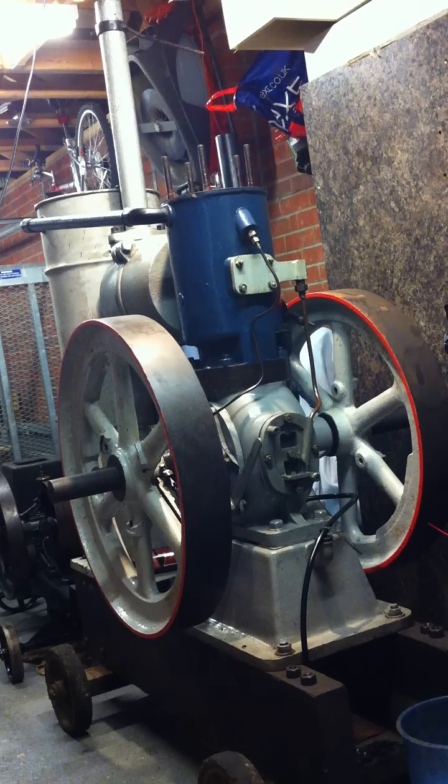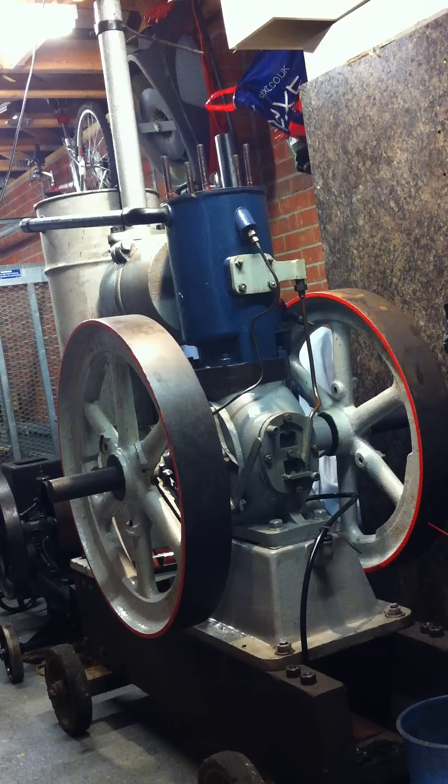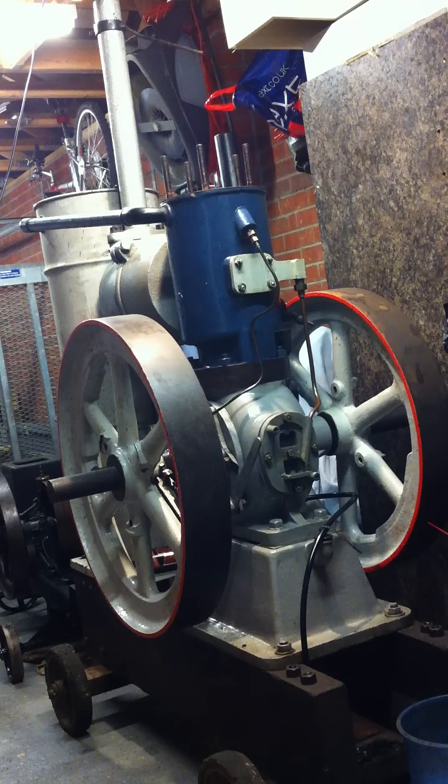This is a video of the Ogle oil engine, just showing that the reed valves are working. The cylinder head has now been removed, and just by rotating the flywheels you can actually hear the crankcase being scavenged as the flywheels are rotated, which you'll see.